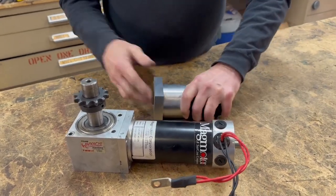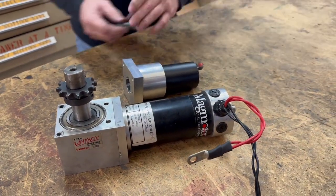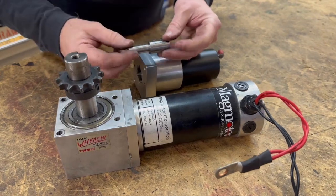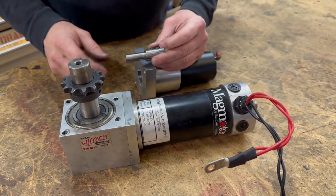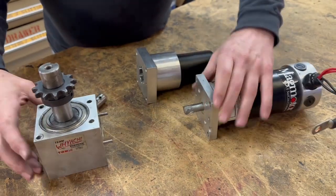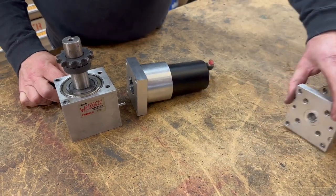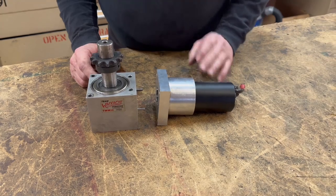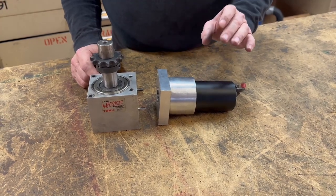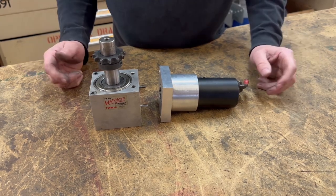It still had a bearing support. I made a custom little shaft to go in there so it could attach to the motor and go into the half inch needed inside the gearbox. This actually worked okay, but I didn't quite have the torque to spin up with this motor that I wanted. Fighting with the speed controllers for brushless control is always a handful.